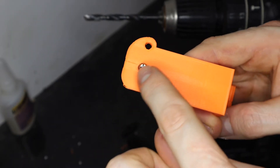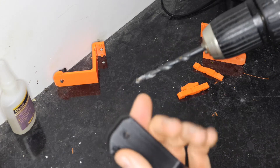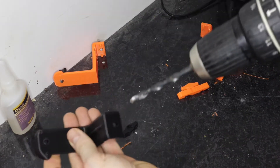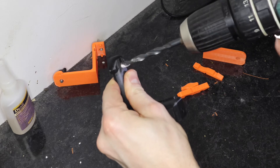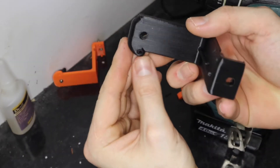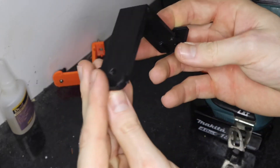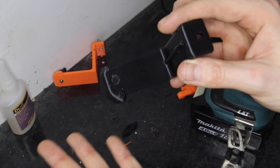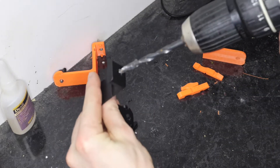You can see here there are cracks where it literally forced the layers apart when I screwed it in - I don't want that. I want the bolt to flow through freely. So all I'm going to do is slowly ream these out with a drill. I'll apologize now if you're wearing headphones because the drill is quite loud - you might want to turn it down. I'm also checking just to make sure I haven't gone through too much - I'm looking through the hole to check the infill, since these are printed at about 25% infill so there's hollow sections inside.